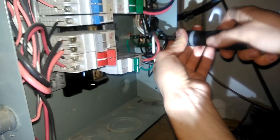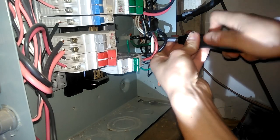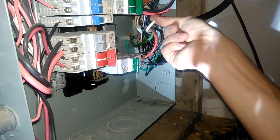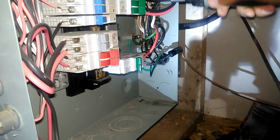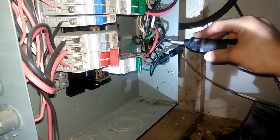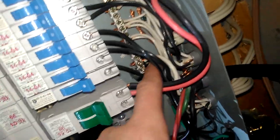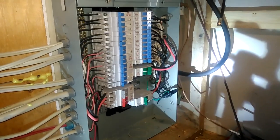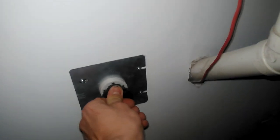Once I had the breaker in place, I secured my ground wire. You can see there's another 30 amp breaker above — the red one is a 20, and the gray is a 40. You can see those also have 10 gauge wire going to them. Then I made sure all the screws were tight, double-checked all my work, and made sure the adapter is pushed through the casing. The neutral is in the back, the ground is attached to the actual back of the panel, and red and black go into the breaker — those are the two live wires. Then I switched the power back on, came up to test the heater, plugged it in, and it was working.